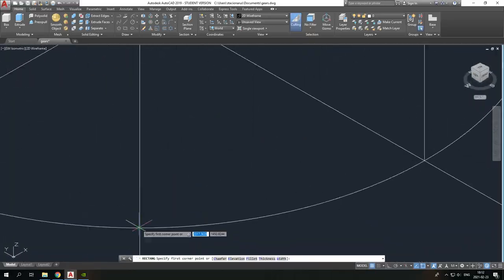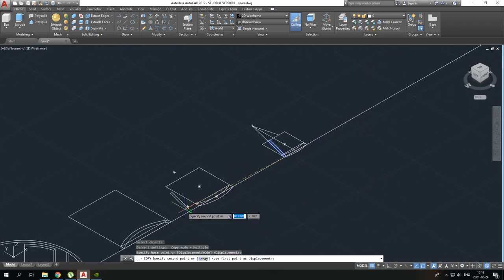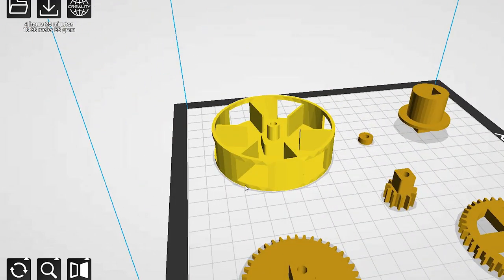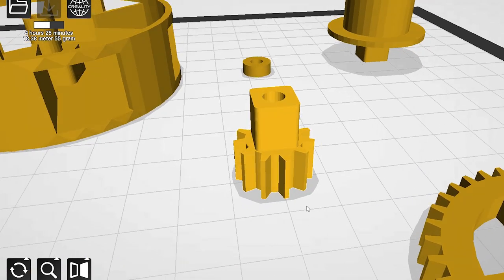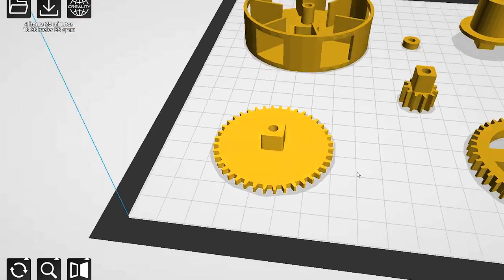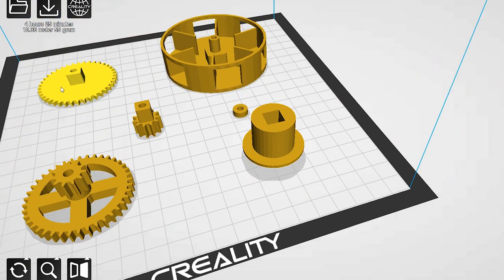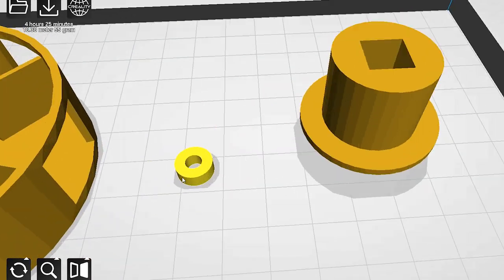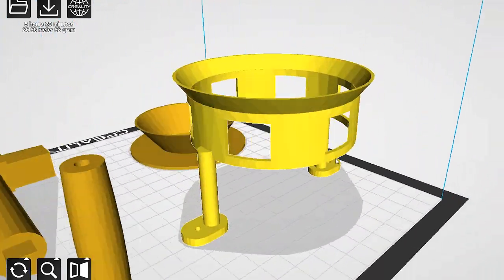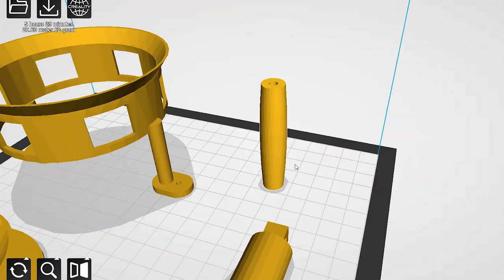I'm not going to show how I made every part, because it would take a long time and be pretty boring. Here is a preview of every part I made: the rotor with six vanes, which connects to the appropriate gear. All parts have 5mm diameter axis holes. There's a connector gear linking to a 4x amplifying gear — two units of this are used. Then there's the main gear connected to the handle connector, plus basic spacers, the siren stator with its own legs, the intake cone covering the rotor partly, and the handle with an additional handlebar part.